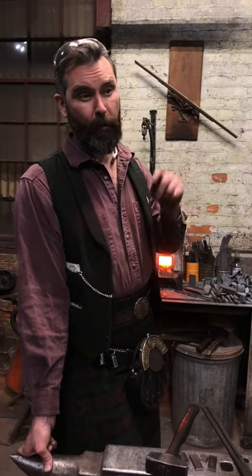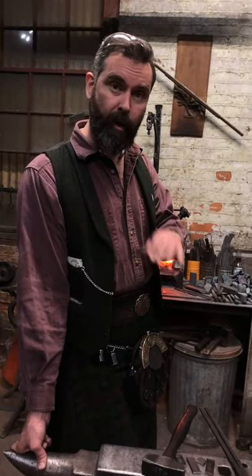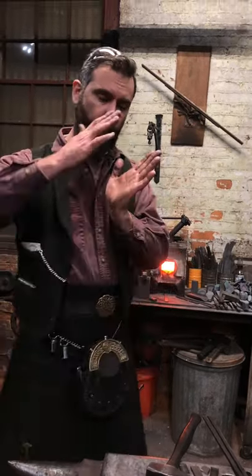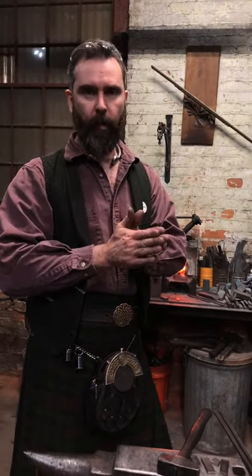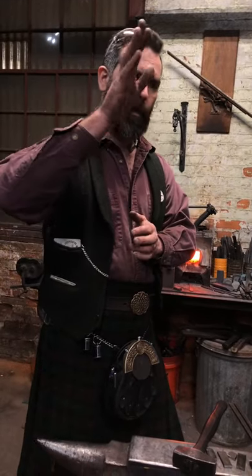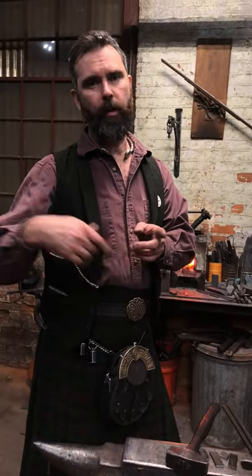And also, from my understanding, the amount of pressure that you put on those plates, so in so doing, creating contact. So it's a positive pressure quench, is what it is. So make sure that you put the same amount of pressure. If you put 5 pounds on one, it's not gonna quench the same as the one that you put 300 pounds on.